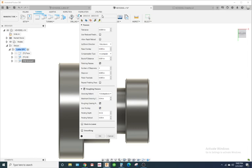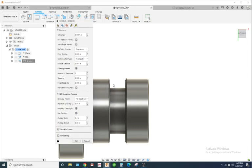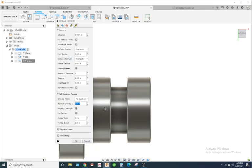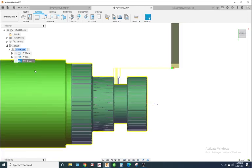Make sure if you're using a larger groove tool, that it'll fit in here. And sometimes with these settings, it gets trickier. The larger the groove tool, depending on what these settings are, it may conflict with the actual toolpath. The software has collision detection, and basically it's going to try to avoid it. If you tell it to back up 40 thousandths and it's going to hit the other side of this boundary right here, it's not going to give you a toolpath, or it's going to give you some kind of error message. So just make sure you got that. But this should be good right here.